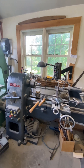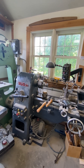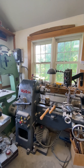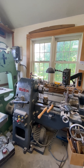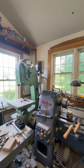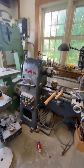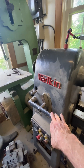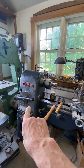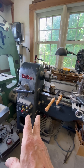Richard Finley and Keith Gottschall out of Colorado have both recently put up videos on converting the Wadkin RS lathe into a variable frequency drive speed control center. Although they've done a marvelous job, I'll give you my input as I'm a bit of an expert in VFD conversions. Both Richard and Keith have two-speed motor drives for the RS, meaning there is a low-speed motor winding and a high-speed motor winding which gives them a larger range. The VFD doesn't require that at all, so I'll show you what I would do, which is different from what they've done.